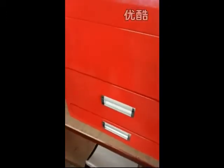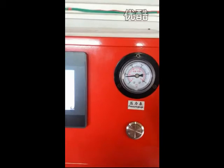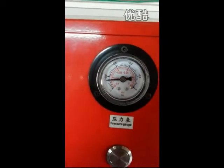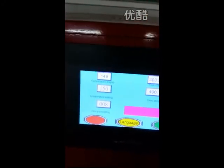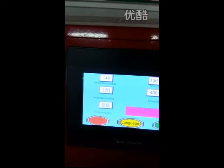After the 8 pre-heating seconds, the vacuum pump starts working. You can see the vacuum gauge is very steady, which means our vacuum pump is very good. The temperature display reads 154, 153, 152 — very accurate because we use a PLC control system and hot air circulation function.